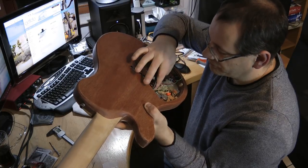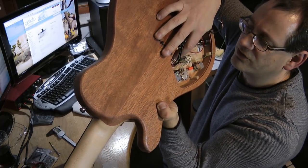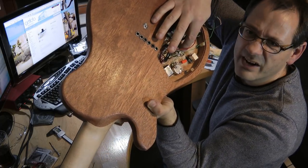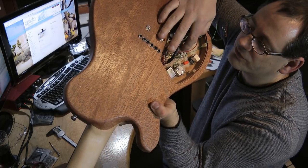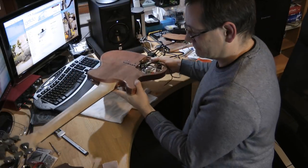I also had an issue that I didn't have the right screws. And so what I've had to do to fix that blade switch in is to create two very small blocks of wood there, which I've actually screwed into in order to fix that down. So that was a bit fiddly too. But now I reckon I'm ready to do the soldering.